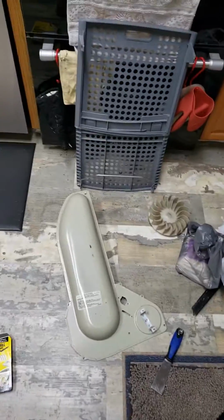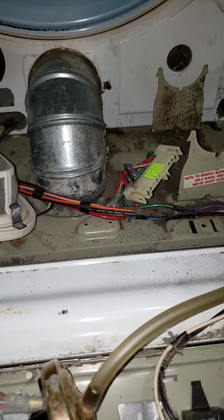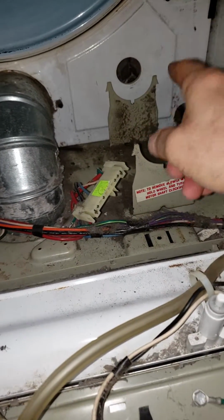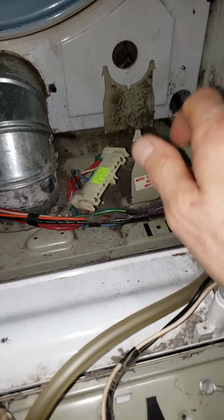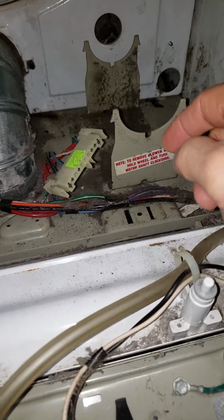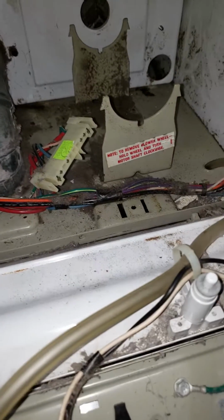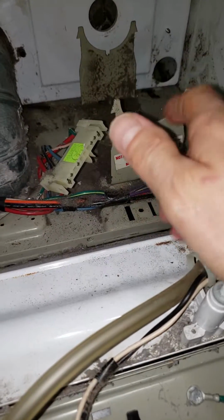on squeaking dryers. If it's not the belt, which you can deduce by removing the belt, then you take your motor, and this is how you diagnose it. So you remove your belt. You turn your motor while it's still in contact with, and this is all hooked up with, a blower. Turn the motor, if it still squeaks, then you disconnect your motor, right? And then you turn the motor. If it doesn't squeak, then you have this problem I'm resolving, okay? If you turn the motor and it squeaks, it's probably your motor bearings, okay?